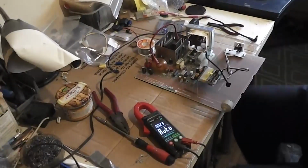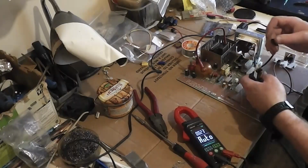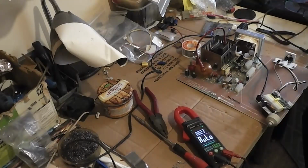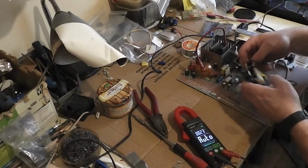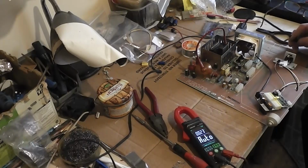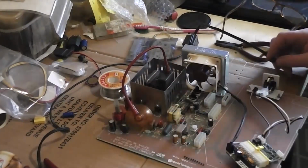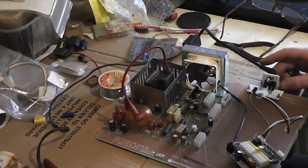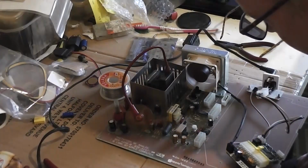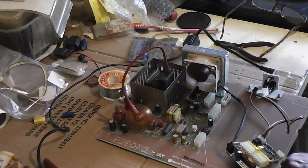Okay, I'm back again. We've reversed the fan around the way it's supposed to be. We are not going to plug it in yet, but so far so good. We're getting the correct voltages. We're taking the fan directly to the PICO. The on off switch is working. Yeah, everything looks good, so we'll just connect it up again and test it one more time. Can you see that there? You see the fan here? Yeah. So power in, that's our 12 volts in, and power on. Our fan is blowing air out the back the way it's supposed to. And you can barely hear it again, and it's getting full 12 volts, so it's going flat out. But that is so much quieter than the Macintosh, like the original fan.